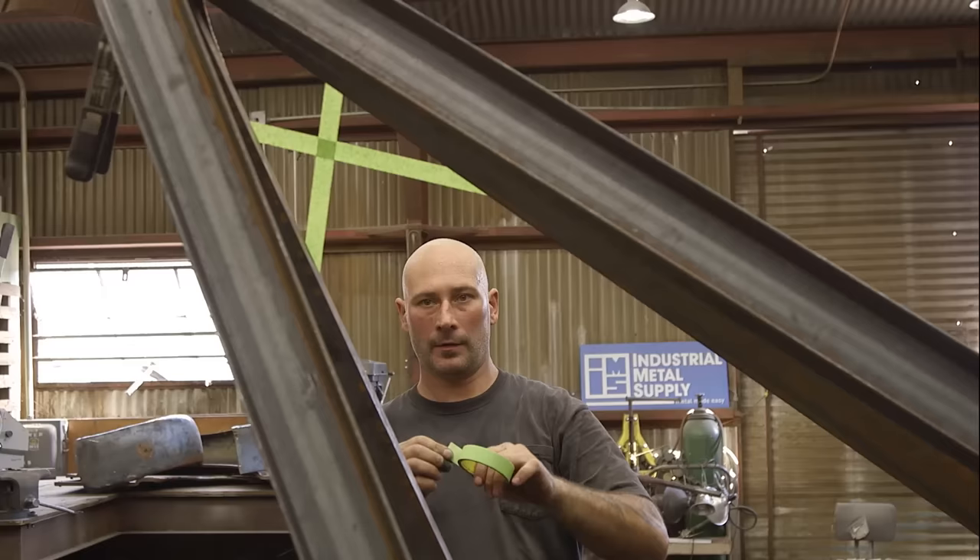We've got three pieces that don't belong together — my mission is to get it right. We're going to cut the whole lip off of the inside of the Model A fender, and I'm going to cut the lip off of this truck bed. Join them together with the sheet metal flange and then position it on the truck — I think that's the easiest way. It's already starting to look more utilitarian. The whole thing with this truck is it's got to look like a work truck. The most straightforward way through this is to just put in the giant panel first. The rear is the more challenging one, but at least now there's a big structure holding it all together so I can mock up the bed on the chassis.